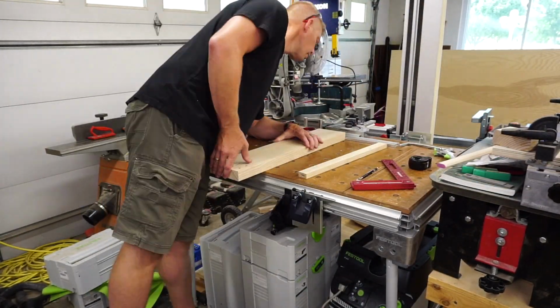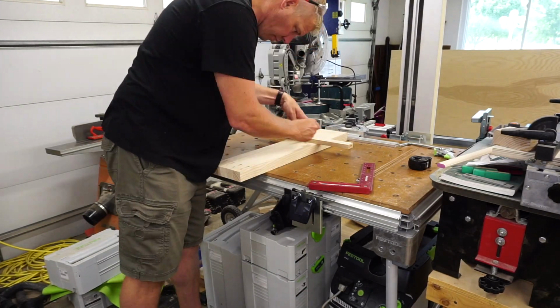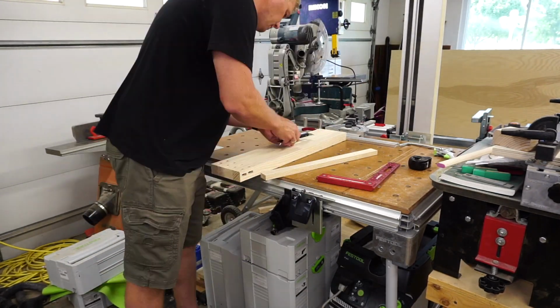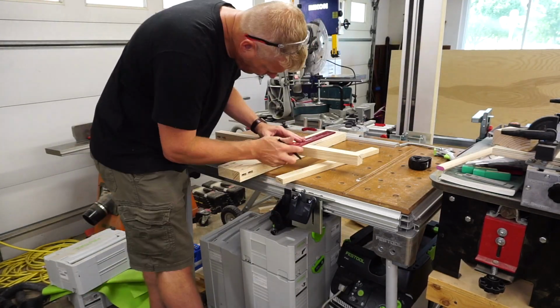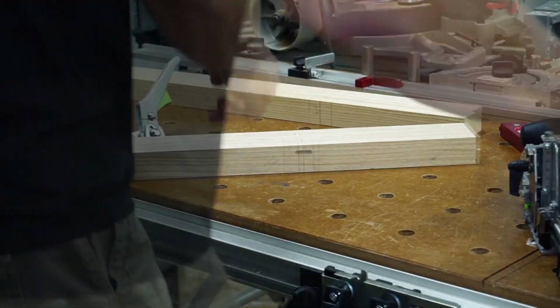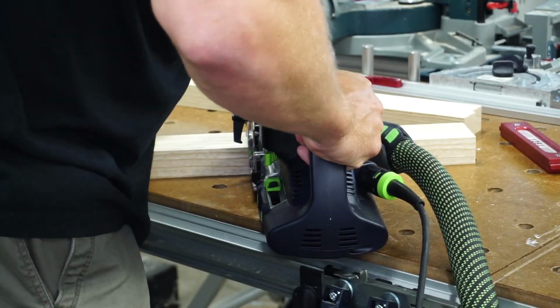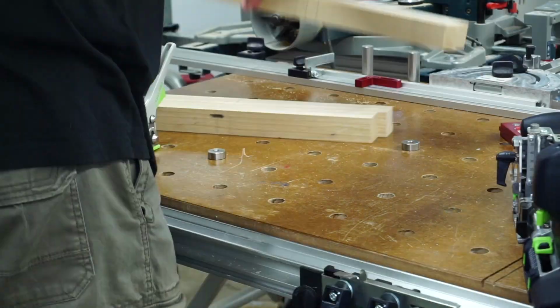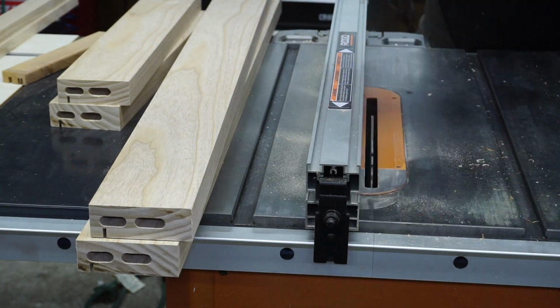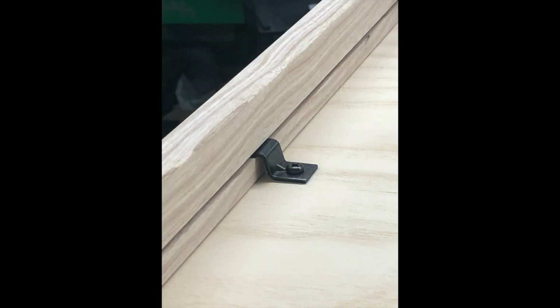Here I am, back to mortising the lower stretchers as well as all 4 legs. I took my time to triple check and make sure I was making all the mortises in the correct location on all 4 faces. And next I cut a groove in the top apron pieces as well as the lower stretchers to hold table clips, which will be used to attach the top case to the lower frame as well as the lower shelf to the stretchers.